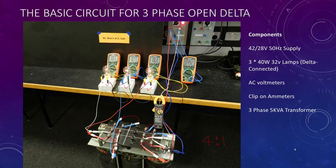We've simply taken the start of the white and the red phase and looped them together here. We've connected one phase into there and the other phase into here. The blue phase has come to the center, the red phase is on the red phase winding, and the white phase is on the white phase winding — creating this open delta effect.